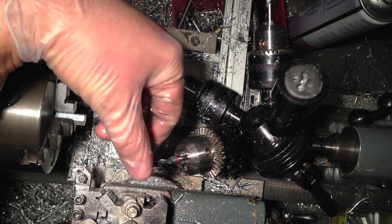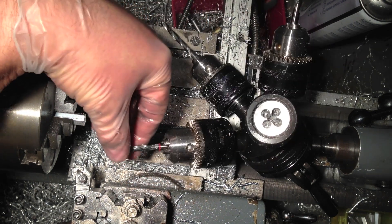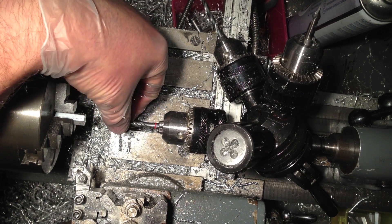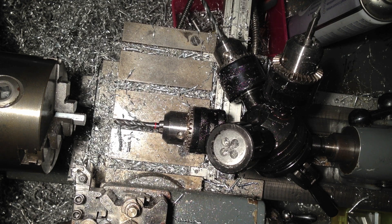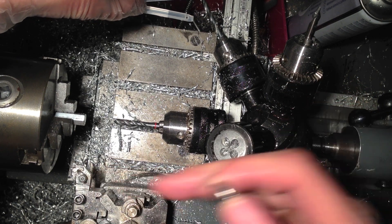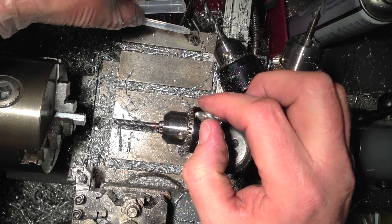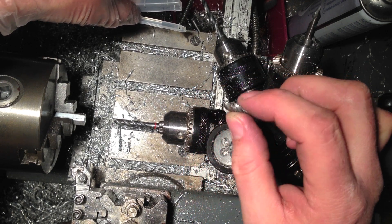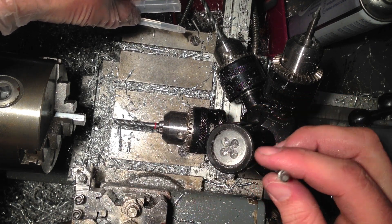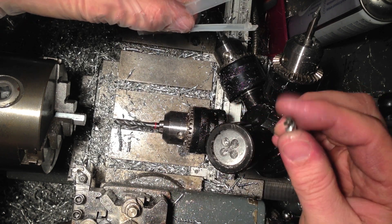This is a red ring high-speed spiral tap, which is typically used for steels as opposed to aluminiums. I did have a yellow ring, which is more ideally suited apparently for doing aluminiums. The problem I found with this — occasionally on the reverse cycle when I'm ejecting the tap from the aluminium, it would pick up on the leading edge, pick up a chunk of aluminium, and consequently score all the thread coming back out. So I've had excellent results so far with the red ring — this is my reserve, so to speak.